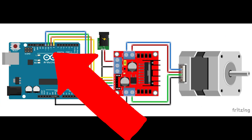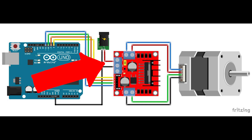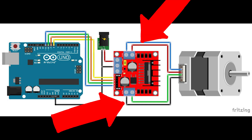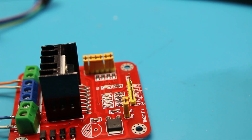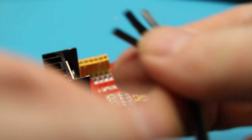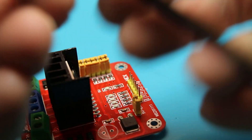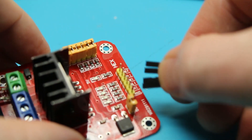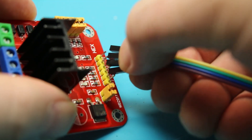Wiring is simple. We need four different control wires from the Arduino I/O, a ground shared with the Arduino, power to the module, a power supply for the module, and four wires going out to our motor. Additionally, yours may have two extra pins like mine for enable. If you don't have jumpers on the board, you need to tie your enable pins high to keep it enabled all the time, or you can pulse-width modulate them for controlling a DC motor.